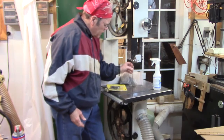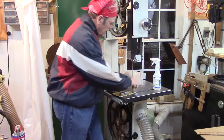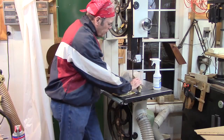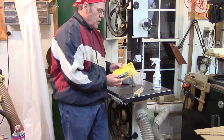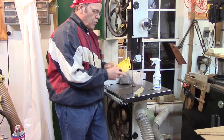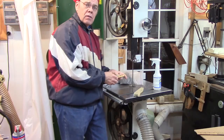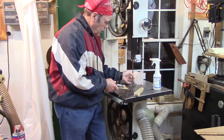The pitch has a tendency to gunk up on your wheels. Sometimes I clean those when it's moving with a flat piece of wood like this, holding it right up against the wheel as it's turning to try to clear it. Before I use it though, I try to remember, I don't always do it, to use a saw blade lubricant like this. It's basically just a soft wax stick. I think any soft wax would probably work. Actually, I haven't tried it, but even some floor wax would probably do fine